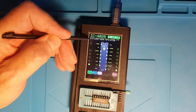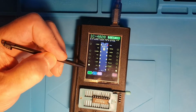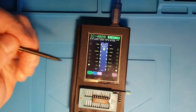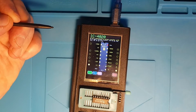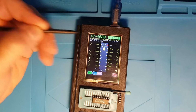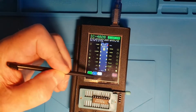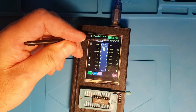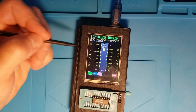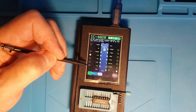Okay, it's now doing 6 counts. Now you might have noted there that it was actually showing us the outputs changing as it ran those. That's because it's utilising the new multiple test facility, which we can see a bit more. So there you go, it's done 8 more counts, /32's gone high. Now when we move on, up here we've got a progress bar, so it's running in slow mode at the moment, and in slow mode it shows us all of the outputs after every single step of the test case.